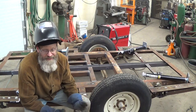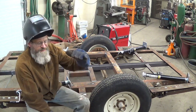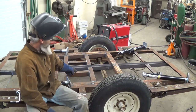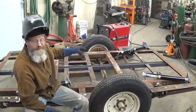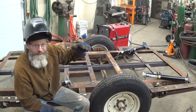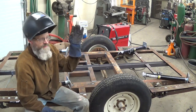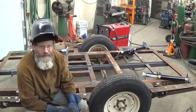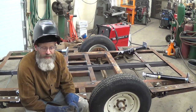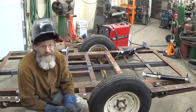That's it for today. In the next video, I'm going to work on the B-fork that lifts the boxes. The reason I'm doing that is because I need to know how tall I'm going to end up having it — that will determine how tall I'm going to cut this pipe. I don't want to be over height, I don't want to be too short. I want to keep the overall height as low as I can and still accomplish my job. The taller it is, the more it's going to want to flip over going down the highway. I hope you guys enjoyed this video — questions and comments are always appreciated. Have a good day, we'll catch you next time.